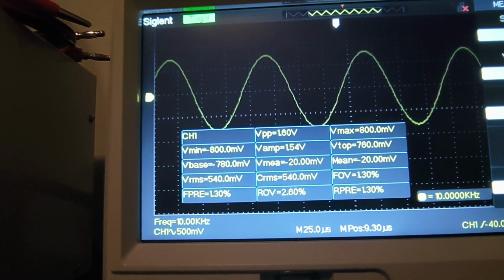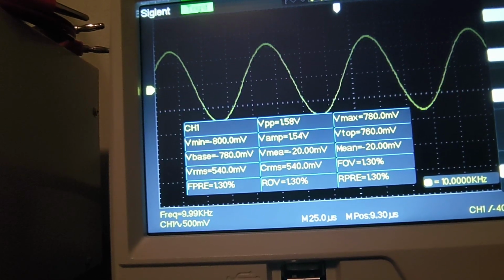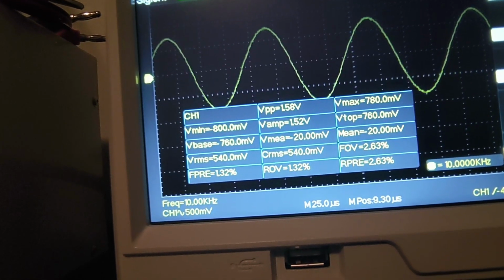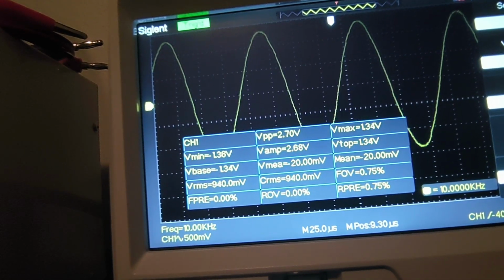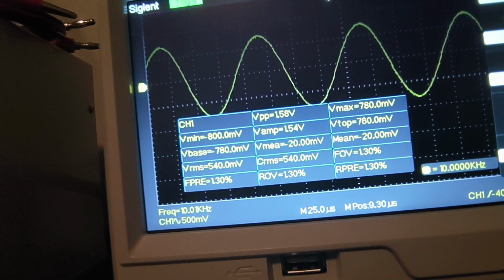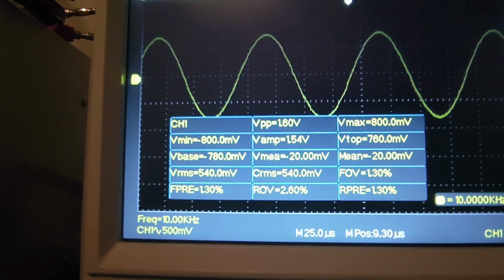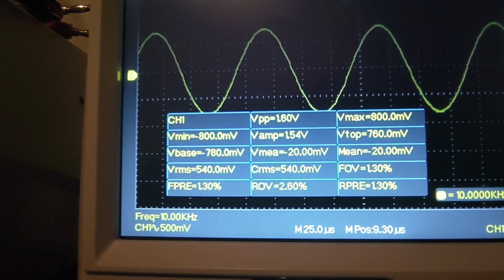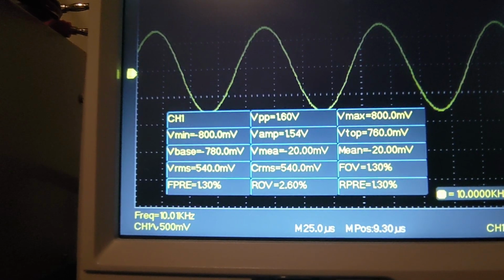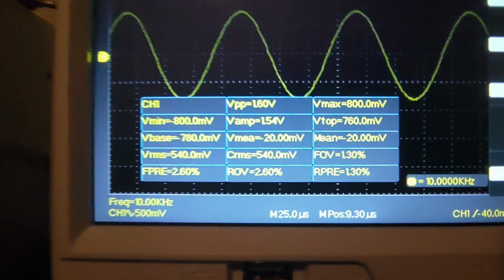Pretty sure there's a voltage going through the potentiometer that's biasing something to create that amplification. See, it gets a little distorted up through that range. Could be just a condition of that potentiometer. Could need some cleaning. But anyways, let's see. At -15, we are measuring 540 millivolts. Now let's go up to the +15 side.